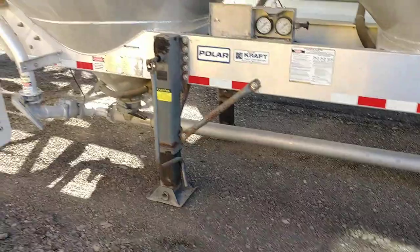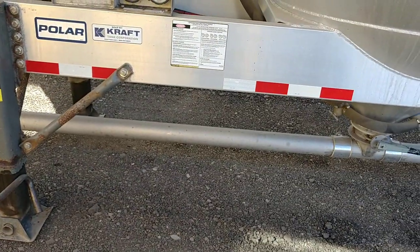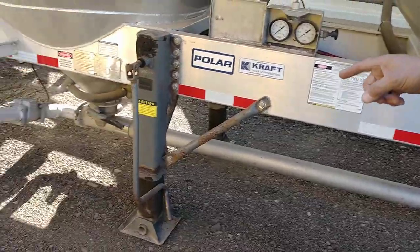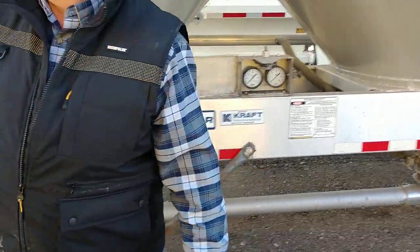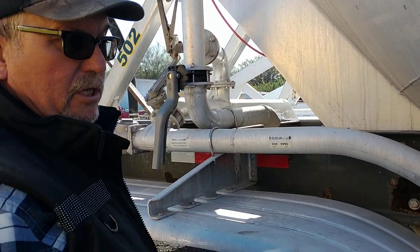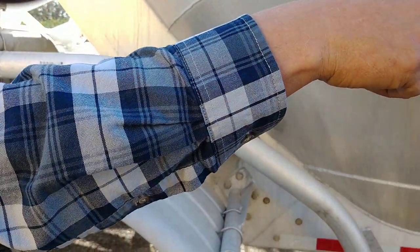Once you get all of these unloaded, close up this valve and this valve. Build it up about 10 pounds of tank pressure, then open up all your tank valves and blow it out. As soon as you get to that one, go back, close that one, close that one, then close the front one, and open up your line valve all the way. Sit here for a couple seconds, let it blow out, watch your pressure. It'll start dropping — when it gets down about zero to two and a half, open up your tank valve blow down valve, then walk up, push the clutch in, shut your PTO off. Unhook your line, put your line back, make sure you put the cap back on the blower. Then come back and unhook your line from your silo and pull away — you're done.